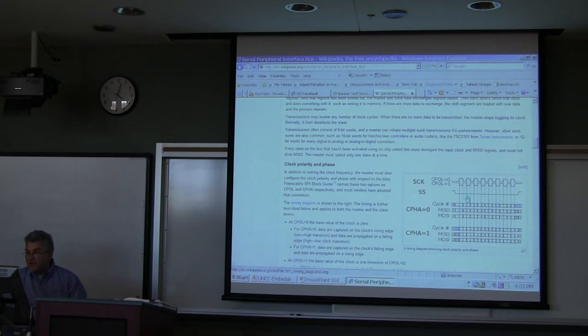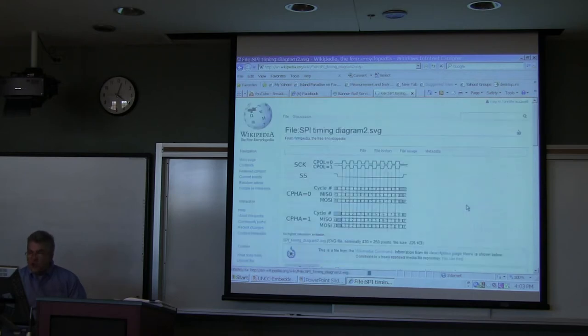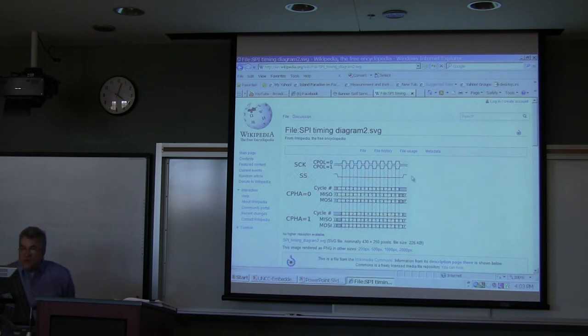Then on the falling edge of the clock, the next bit of data is put onto the serial line. And then on the rising edge, the slave peripheral device will actually look at that in more detail. So as you can imagine, if you make this very fast, the width of the availability of this is small, and any sort of noise or any sort of problem, glitch, whatever that might happen, has a better chance of affecting your communications. So by going slower, you make this time right here longer. So it's better to communicate at the slowest which you need.